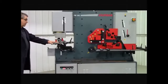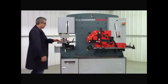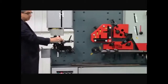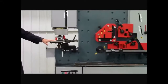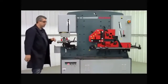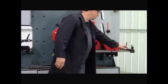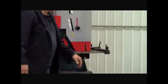You've got gauging tables at every station. On your punch you've got a rear stop and a side stop here, so if you're setting up for a repetitive job — a piece of plate where the hole has to be in the same spot all the time — it's ideal for that. You've got side gauging on the flat bar shear and same on the notcher for those repetitive jobs.